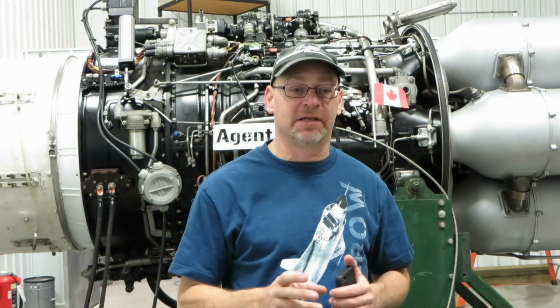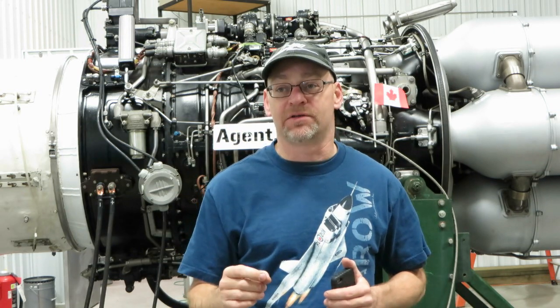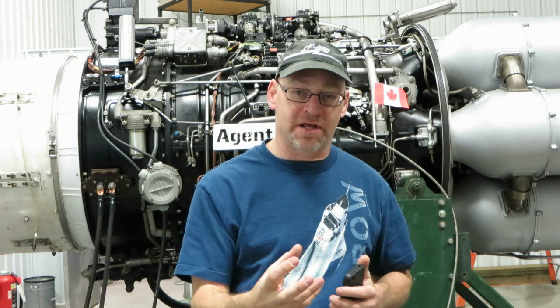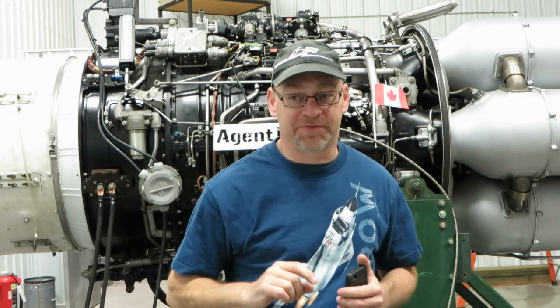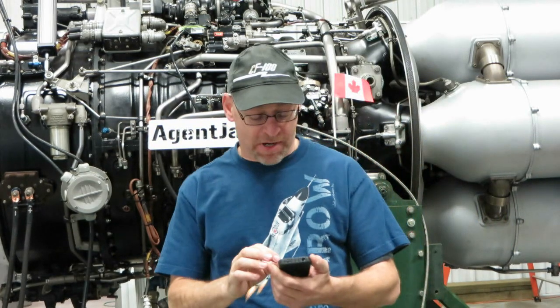In many engines there are allowable cracks in certain areas of those parts, because they get so hot that they crack. Different engines have different specifications and allowable limits for cracking. The combustion liner — or combustor inner liner — also has areas that are pre-drilled to relieve cracking, and there are acceptable cracks in certain areas while other areas are not acceptable. The fuel-burning part of the jet engine gets very, very hot. It's beyond the scope of this video series to cover all types of allowable cracks, but it is not safe to assume there is no allowable cracking in modern jet engines.